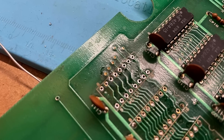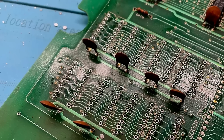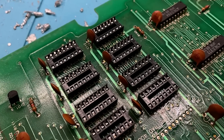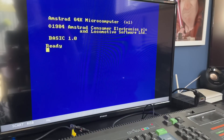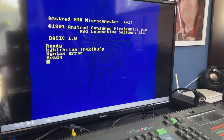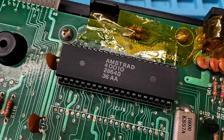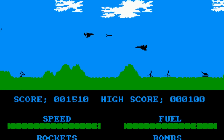While I was waiting, I pulled all of the old chips and fitted these lovely new sockets. Popping in the new chips, let's cross our fingers — and voila! A working CPC. I'm really pleased with this, as I was fearing the worst and that we might have been on a hunt for a new motherboard. But it appears that if I did offend the Amsoft gods by saying how terrible Harrier Attack is, they've gone easy on me at least.